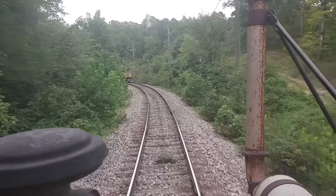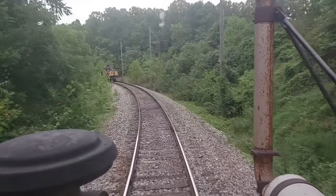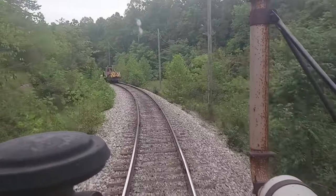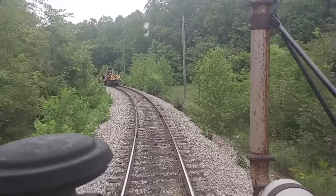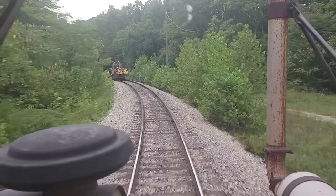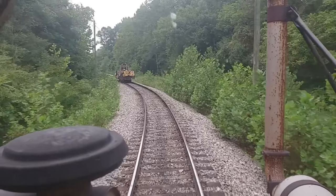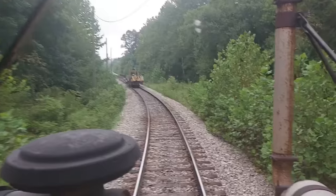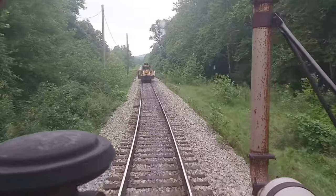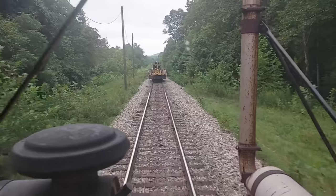Anyway, I went up and tamped that spot we fixed yesterday. Then coming back in, we replaced about 10 or 12 missing bolts. One thing about 16 miles of jointed track, you always got work to do on your joints. Bolts break and come out all the time. Just the nature of jointed track. But we keep ahead of them. About once every week, I go out and do a bolt run, a track inspection, and I fix bolts with a track inspection.